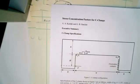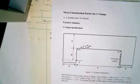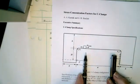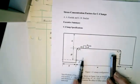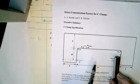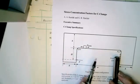It's called a C-clamp. It's a solid piece of steel. When we say it's solid, its thickness is 1 1/4 inches. That's a heavy piece of steel. These things are not easy to put in place. And where these things work is you put them over something in here, which might be the flange of a pipe. There'd be a pipe coming along here, and there's a flange or a joint, and there's a gasket in between. What these things do is they lock it. And so if for some reason the gasket starts to blow out here, then these things keep the whole thing together.